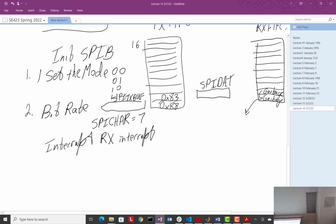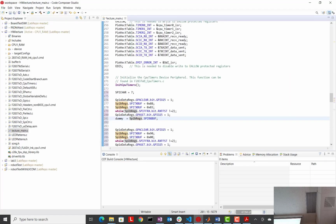So it clunks down, and then we do one more read right here. You can use the same variable, and copy this line of code. Control C, and do it again. Same exact line of code. Okay, that pulls, boom, boom, both those values off the FIFO.